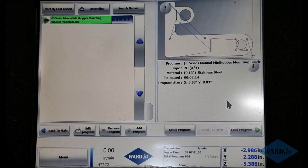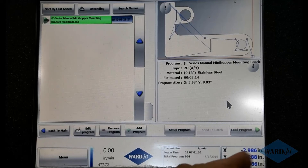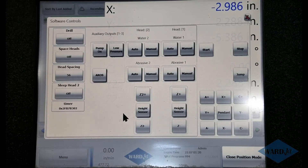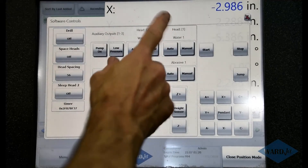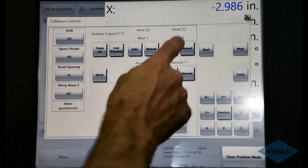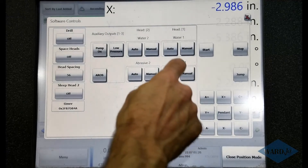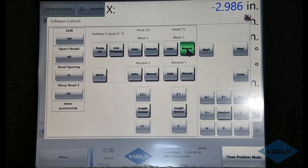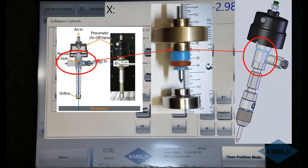Here we are at the Ikulu software. You can do this with either the hardware buttons on the front of the controller or the software buttons — I'm going to use the software buttons for ease of showing this. Tap in the lower right-hand corner and go into jog controls. This machine has two cutting heads — head one and head two. I just replaced the orifice on head one, so first thing I've gotten in the habit of doing is hitting the water manual button for the head you're working on. That lifts the little needle off the seat above the orifice and allows water to go through the cutting head.